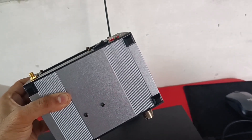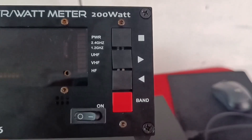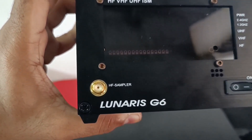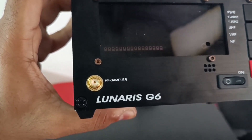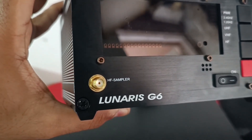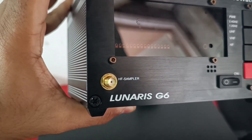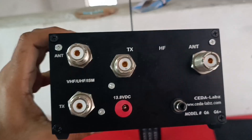The build quality is excellent. The enclosure is very well made and everything goes together very well. So that's the band button, the up-down key, and the menu key on top. The holes that you see on top of the power button are the holes provided for the buzzer. This has a feature which gives a buzzer if the reflected wattage is more than what you have set in the menu. We'll see that in action. A very good looking piece of equipment.